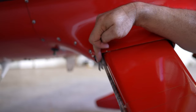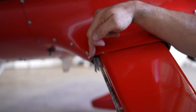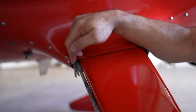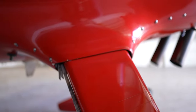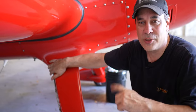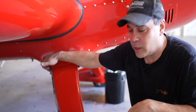These are the two hoses and vents I mentioned. One is a drain that goes to the outer shell of the aluminum tank — if the tank ruptured, it won't drain into the cockpit, it'll drain here and we'll know there's a problem. The other is an air vent for the lines, going up to the tank to allow air in as oil is pumped out into the system.